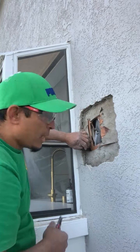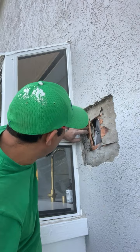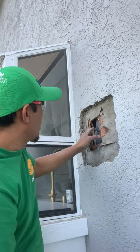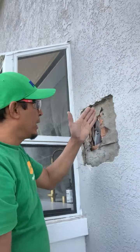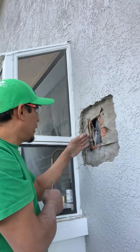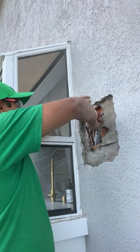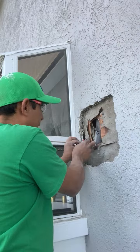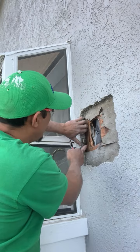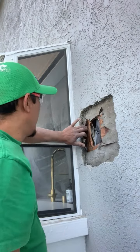Okay. If there is a lot of layers of paper, like in this case, there is one flashing, 1, 2, the first paper, and 3. There is 3 because maybe this piece gets up to here, and from this point to here, they put another piece. That's why it's sometimes double. So I'm gonna leave the first 2 layers, and the flashing I'll be leaving on the inside, okay, like that. Flashing is gonna be inside, okay.